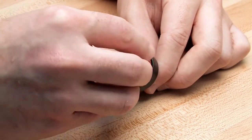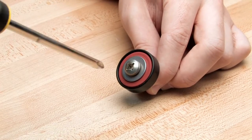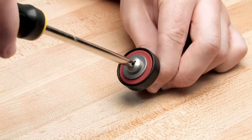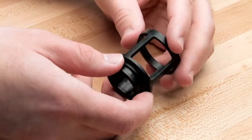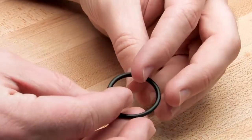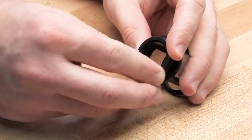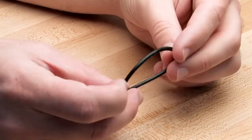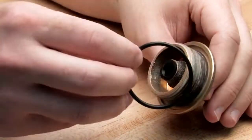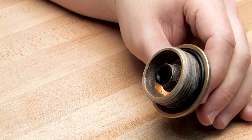Reinstall the washer and reconnect the assembly with the screw. Likewise, inspect the seat and seat O-ring and replace if necessary. Reinstall the O-ring around the base of the seat. Finish by inspecting the cover O-ring and reinstalling it around the cover. After your inspection, lubricate both the cover and seat O-rings before reinstallation.